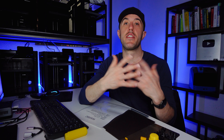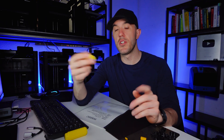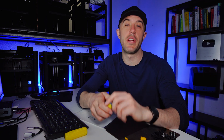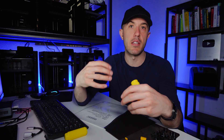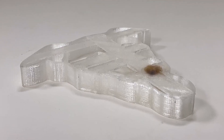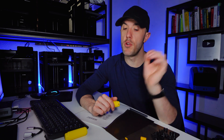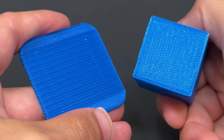Very last is coloration. This is most critical for light colors like yellow or white, where contamination is prevalent and easy to spot. Filament can burn on the nozzle, there can be purge material, a speck of dust on the bed, or residual color from a previous machine if machines had to be converted to new colors — all of which can cause staining on the first layer. They also inspect the rest of the part since blobs or residual material can break loose. The rule is: on the base layer, are there any stains larger than one millimeter in diameter? If smaller than that, it will remain. To avoid this, you can design a sacrificial raft underneath, or print in dark colors — black never has stains.